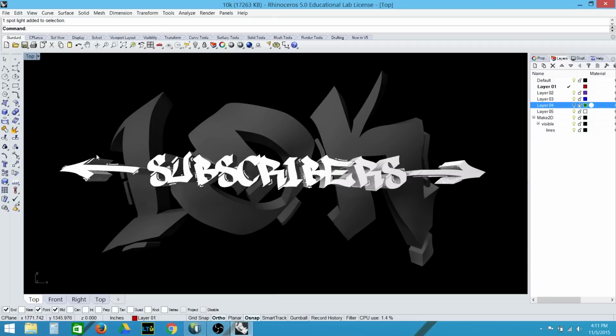I would normally model the thing that I wanted to make and then figure out how to produce it. In this case, I'm going to produce a 3D sign from a 2D image using a displacement map. In rendering, a displacement map is used to add depth and texture to a model. This is usually just used for making images, but I'll use it to produce a 3D model and machine it and then cast it in aluminum.